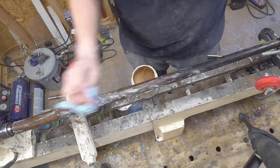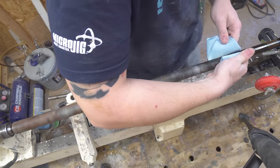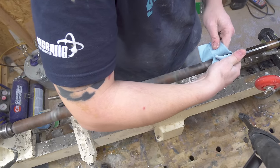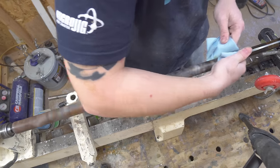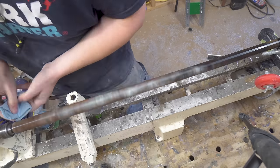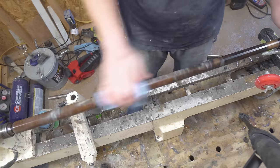This wax is kind of heat-activated so you want to turn your lathe up to a tad bit of a higher speed and apply a decently firm pressure. But be careful while doing this, as if the rag binds it will pull it out of your hand or could put your hand into the lathe.